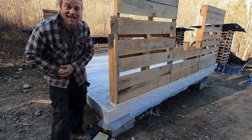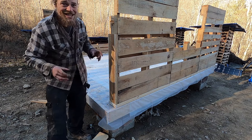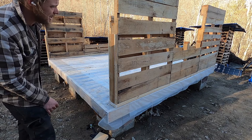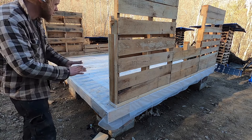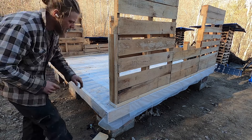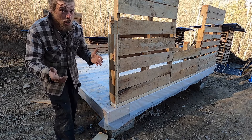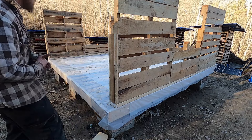Something worked because they are standing up. Not only is the floor correct, but the walls are correct, at least at this juncture. They could obviously go all kinds of sideways later, but right now the fact that they're standing up on a pallet floor — this floor is not completely sheathed, there is no plywood on it — that means a rim board is perfectly level with the pallet board. Since all these pallet boards are slightly different thickness, that is a heroic achievement. Rock and roll. It's working. It's working well.